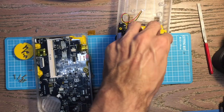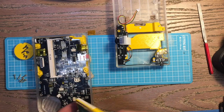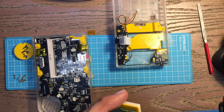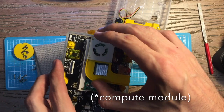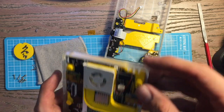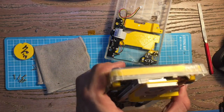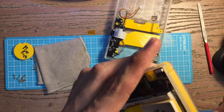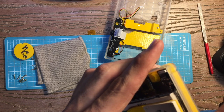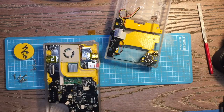Now that we're sufficiently protected there, the remaining steps: since I'm putting this back together I need to get my extra PCB out of there. Installing the circuit sword, making sure to connect the fan connector. Do be careful with the fan connector — it's not meant to go through a lot of cycles, so just be gentle with it.